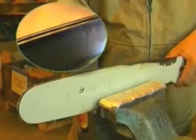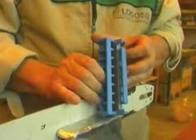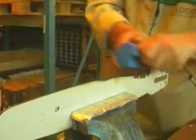The guide bar must also be maintained, mainly by filing it with a flat file or a special edge file. A worn chain wears the guide bar most. The feed pressure increases, the chain oil film that protects the guide bar and chain is worn off, leading to very rapid wear of the guide bar and the underside of the chain.